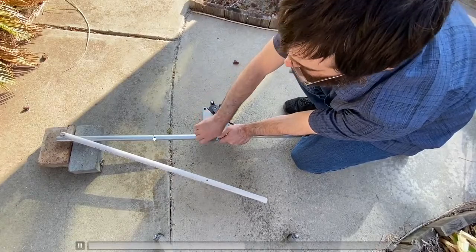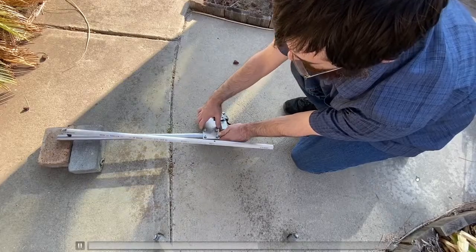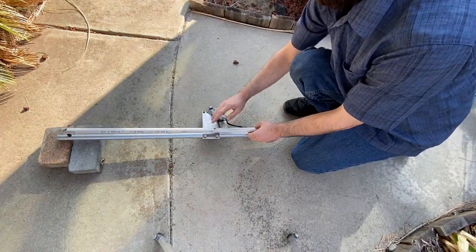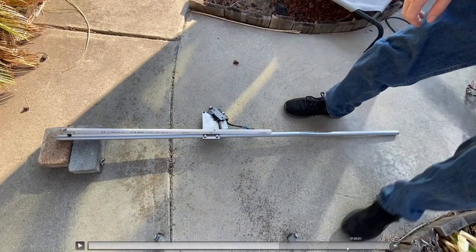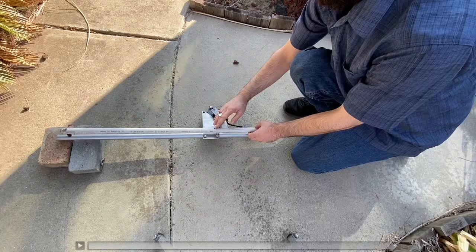And here I'm lining up, so I got it right, doing a hand tightening. And again, just checking it's the right position. I'm also at this point checking the distance. If I go back, the distance of that spacer here. If I find that I don't have enough space to clear the cam arm and my motor, I will add a little bit more spacers here or reduce it. You don't want it too far out.